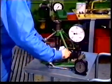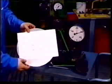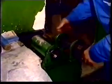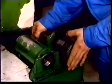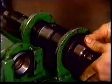Check the spray form. Place a dry paper under the nozzle and give the pump a quick blow. Note the fuel spray uniformity. Check that all orifices are open. If the checks shown give satisfactory results, the injection valve can be installed in the engine. Otherwise, replace the nozzle with a new one.